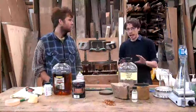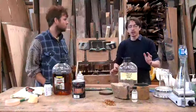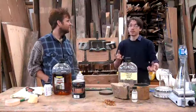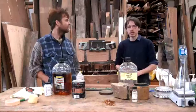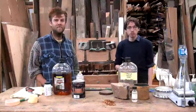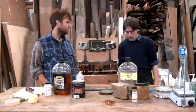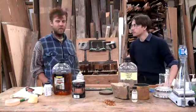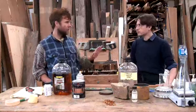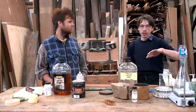If you absolutely had to, for some reason, or you just really, really wanted to, although if it's a 100-year-old, please be a little bit thoughtful, because we don't have so many of these, and it's nice to make them last as best as possible. Alcohol will help, will pull it off, or a paint stripper will remove it. Right. But the strippers are pretty nasty, though. If she's certain that it's got a shellac finish on it, you start with metho, maybe try to blend it all a bit, and that's what I will often do. I will try and rework a shellac surface.